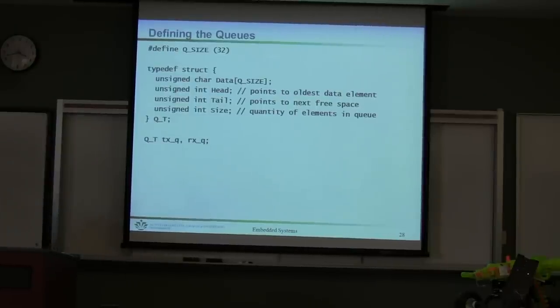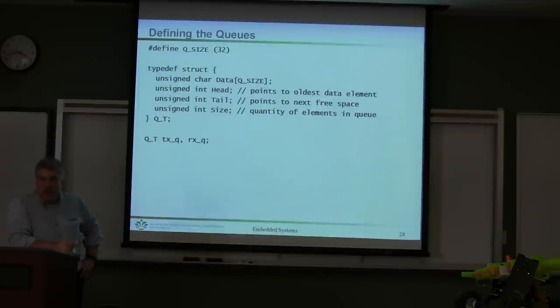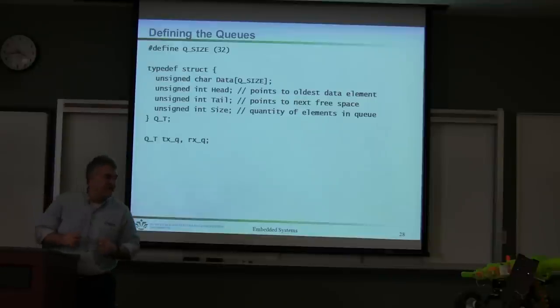He's got 2 days. One thing to mention is that anytime you work with little projects like this, I would recommend in the future that when you do any sort of embedded system, if you intend on moving it at all to try it out, you need locking connectors for everything. One reason is that it's easy to connect and disconnect, but more importantly, many problems have been created in these prototype systems when suddenly something works loose and it's not connected, and you spend lots of time trying to look for it. So I do recommend that you have as beefy connectors as possible to attach to everything. Something to think about in the future. All right, let's continue on.